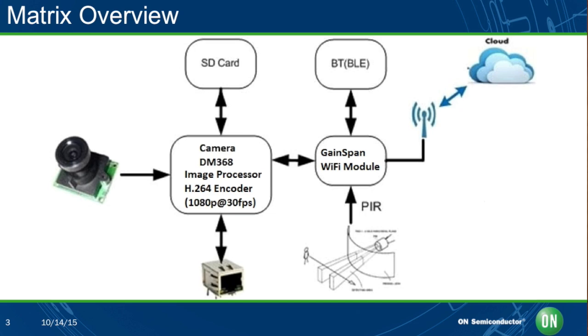Typically, the camera in a smart doorbell is in standby until an event triggers it to wake up. The trigger can happen either through a motion sensor — if there is any movement sensed within the radar of the PIR sensor, it wakes up the Wi-Fi module. Alternatively, the Wi-Fi module can also be woken up if there is a Bluetooth-enabled device that it pairs up with. Once the Wi-Fi module is activated, it immediately wakes up the camera and the image processor. There are essentially two things that follow: you can immediately get a live scene around the doorbell and it starts recording on either the cloud or locally on an SD card. Secondly, there is a push notification sent to your mobile device, giving the user the option of viewing the live video or looking at a still image with a timestamp.